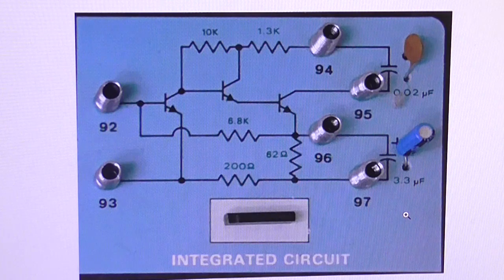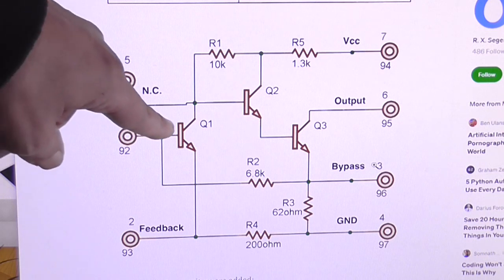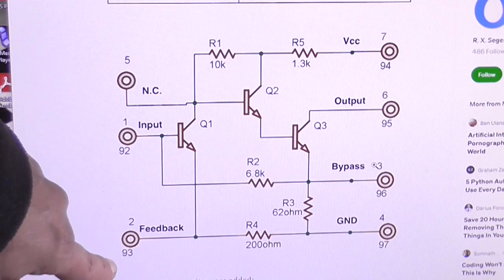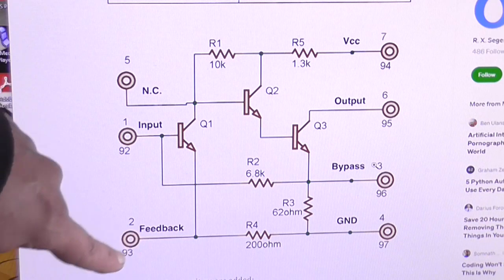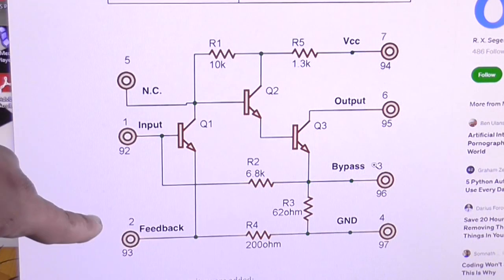But I never actually tested to see how well, and I also don't know how much gain it produces even with this boost capacitor. This other ceramic 22 nanofarad capacitor is just for high frequency stabilisation. And here is the redrawn equivalent schematic. It's a seven-pin SIP or single inline package. Pin five has no connection according to the data sheet, though one article says it goes between the collector of Q1 and the base of Q2 — what purpose that serves I don't know. Pin two, or connection 93 on the board, is used for feedback and usually goes between pins two and one, where you put a small capacitor. One of the circuits used a 100 nanofarad ceramic capacitor across there, so I can test with and without that capacitor to see if it makes a difference to the gain.